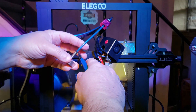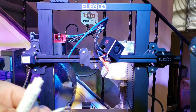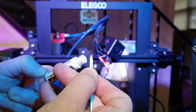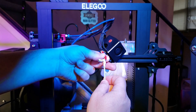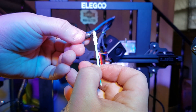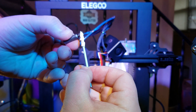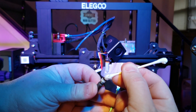In my case, I don't need the entire length of Capricorn tube, so I'm just going to cut it with the cutters. I'll get back to that later. Apply some boron nitride paste — you'll want to put a little bit onto the heater cartridge, a little bit onto the heat break. And if you get some on the face, just wipe it off with a clean Q-tip.